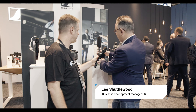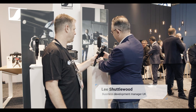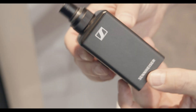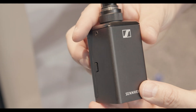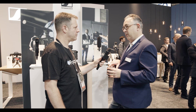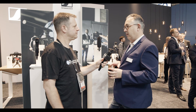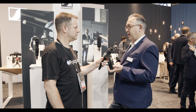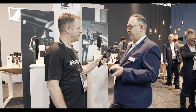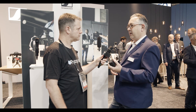So this is the EWD SKP — it's a plug-on transmitter. As you can see, we've got it plugged onto our MKH 8060 here. This unit has two microphone inputs: an XLR input on the top and a mini jack input on the bottom. That allows you to use it as a belt pack with a lavalier mic as well as a plug-on transmitter. It's one channel at a time — you use either that input or that input — but it does give you the flexibility of using this as a belt pack as well as a plug-on.